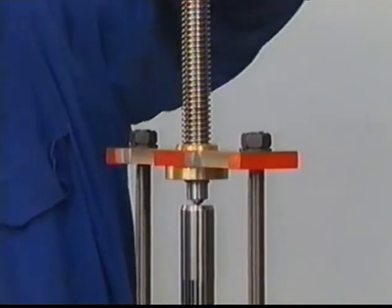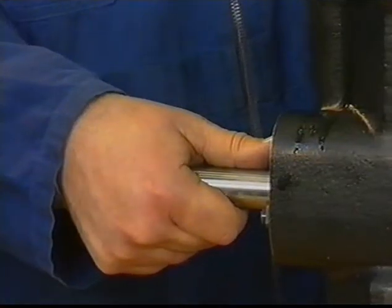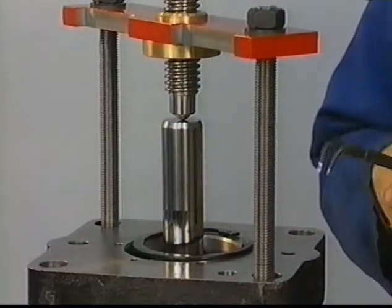Place the assembly tool and compress the spring. During this procedure, the vanes of the plunger have to slide into the grooves of the control sleeve. To facilitate this, move the control rack to and fro at the same time. Place the circlip and release the pressure.